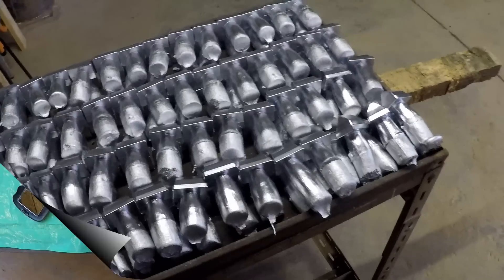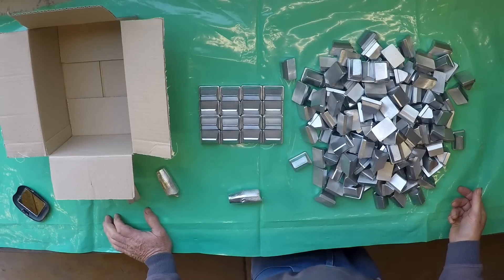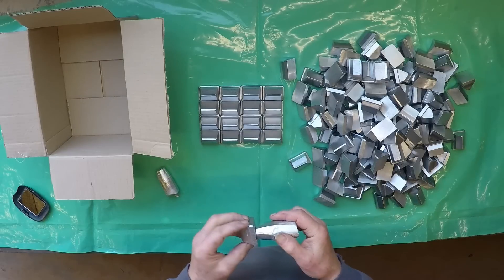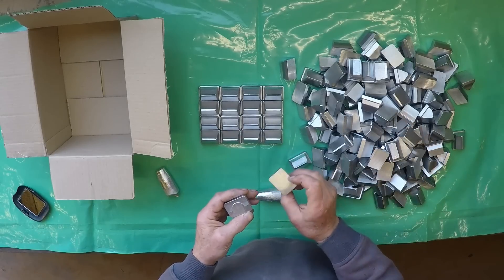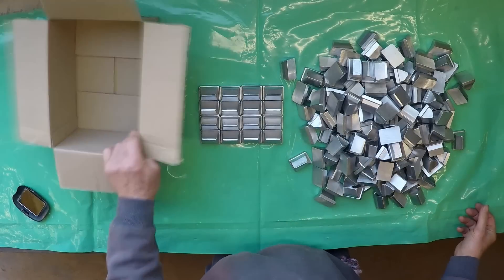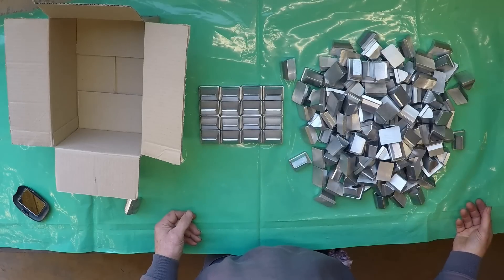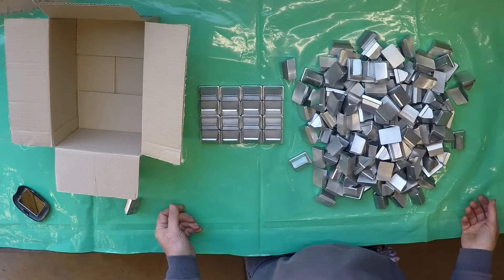We're now at the end of the job — this is the second run of the die, 160 castings here. The first run actually got a few more, I think 166. All I had to do following the casting was cut the feeders off the back, then linish the back where the feeder was removed, so I wind up with a totally flat surface, done on a disc sander. The next little job is to throw them in a box and ring the customer up, and that's the end of it. The die has worked — you can cast aluminium into an aluminium die and get away with it, at least for some time. So far I have nearly 330 parts, and we just wait to see whether I get the order for a thousand, and if I do, whether the die will last that long.